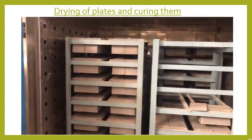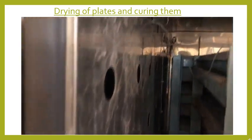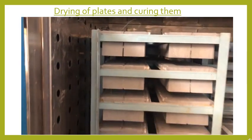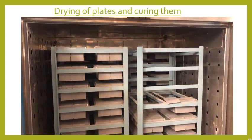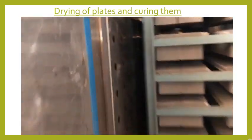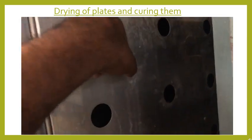In this video you can see a drying oven in which the pasted plates are kept. The machine helps in achieving the humidity and temperature which reduces the time of curing. Hence the plates can be used a bit earlier than keeping them in the traditional way in a dark room covered with wet cloths or gunny bags for around five to seven days.